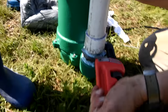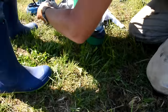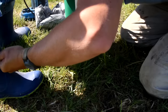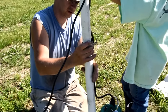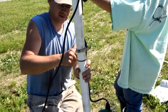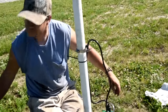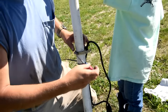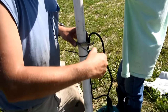You never want your mound system pump to fail without knowing about it, because if you continue to use water, eventually it could back up the inlet pipe. On these old farmhouses, which sit about at the level of that inlet pipe in your basement, you could literally have sewage backing up in your basement. So I'm going to set the floats where they were: pump float about 12 inches above the pump, then about 12 inches above that the first float alarm, and about 8 inches above that the second float alarm — spaced so they can't float into each other.